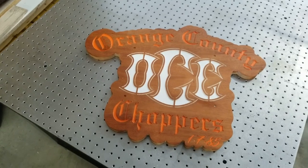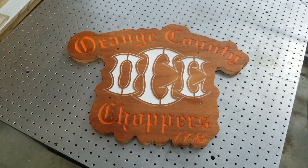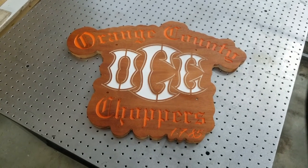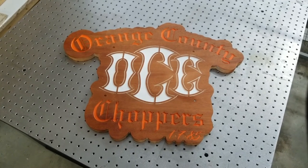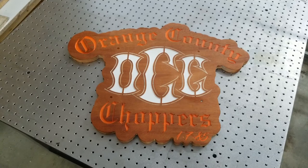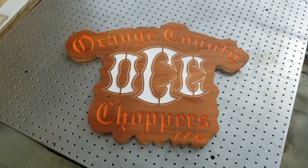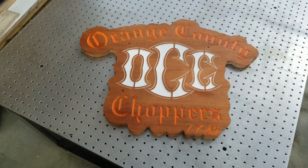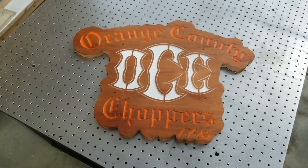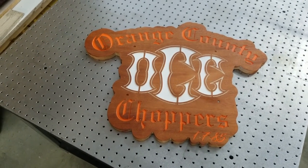This ended up a very good-looking project — just mahogany, rattle-can white and orange paint, an eighth-inch straight cutter, 30-degree V-bit, a Yeti Smart Bench, and an imported Adobe Illustrator AI file brought right into V-Carve. The vectors were all done; we just applied the toolpaths with the tools we had. I coated it with mineral oil and it's a finished project. I'll do a separate video on importing the file and toolpathing since the videos get too long to upload and edit otherwise.